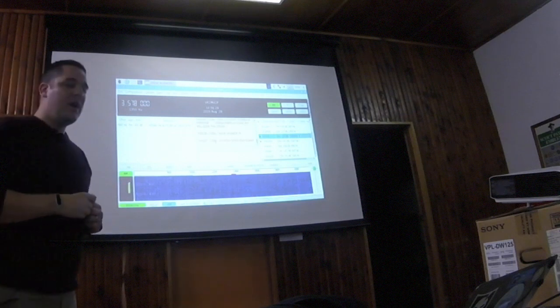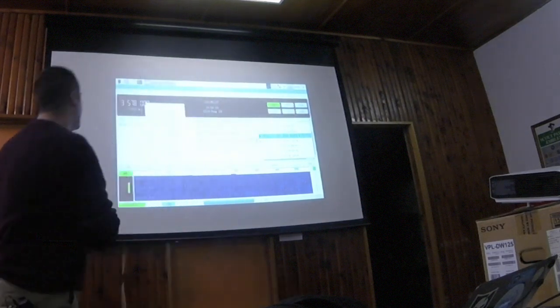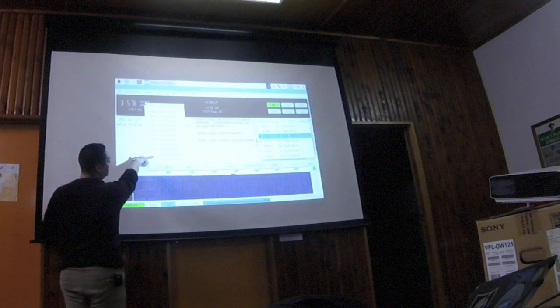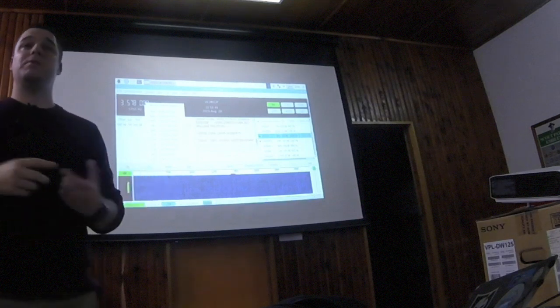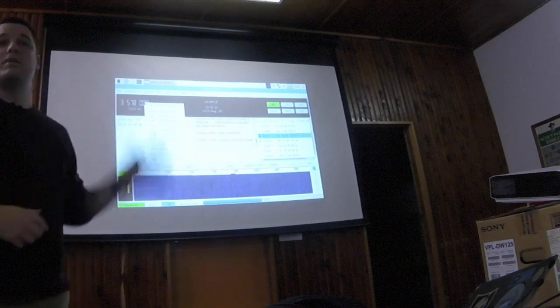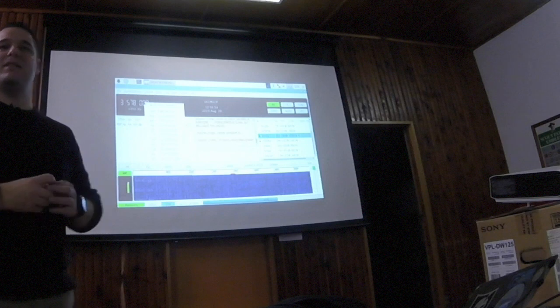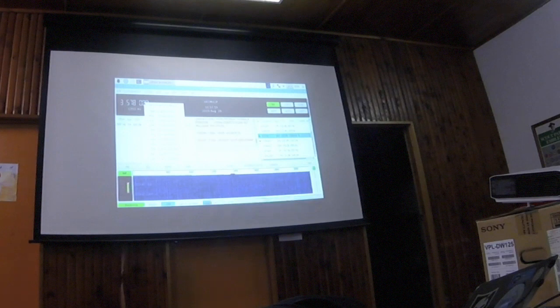So, while we've been playing on 80 tonight, there are suggested frequencies right the way up to 6 across the world, and locally in Australia we've just picked this band if you wanted to have a play. Much like 2 metre SSB, 2 metre Whisper, etc., it's just another digital mode on 2 metres and above. Pick anywhere in a digital segment and any legal band, and as long as there's someone on the other end to receive it, fill your boots. I know there's some guys playing with it on 23 centimetres down in Western Victoria, and they're getting about 100 Ks or something on 5 watts. Which is, you know, Andrew gets further than that on his 2.5 up on a summit.